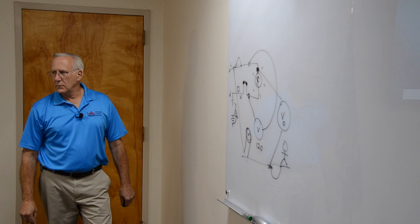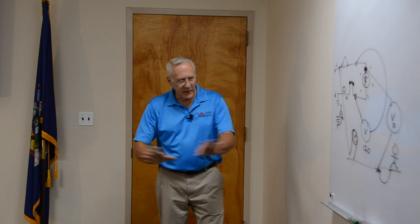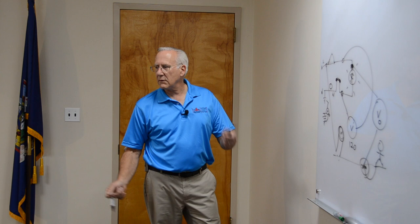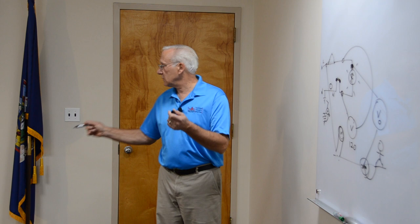You understand? Maybe. Okay. Listen, that's why you're here, to get a little background. But what I want you to take away from this is this concept. When you test something you're going to touch, you want to test everything to ground. You want to test everything to the ground wire. A ground, a piece of steel, a ground wire. Anything, but not to the circuit.